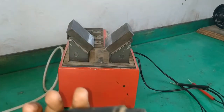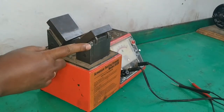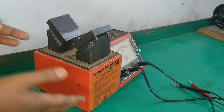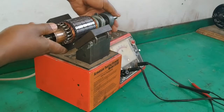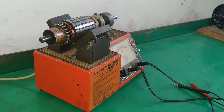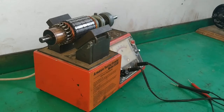When this is connected and the switch is turned on, a fluctuating magnetic field will be generated. The magnetic field alternates — north, south — it is an alternating magnetic flux. So when the armature is placed on this growler, the armature winding will be exposed to an alternating magnetic flux. By looking at how the armature reacts to that alternating magnetic flux, we will determine whether that armature is okay or if it has an internal short circuit.